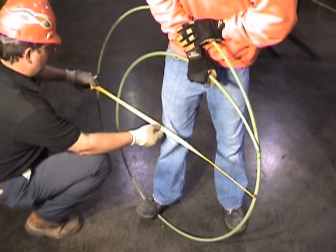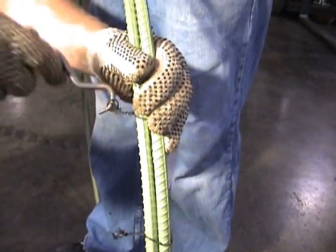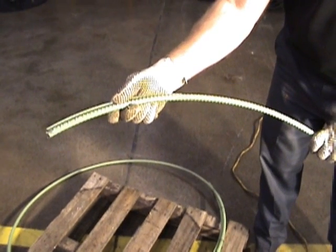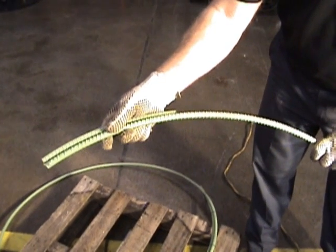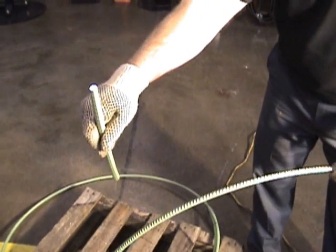The men will be shortening the rebar circles that are provided with the Mr. Manhole tools and using the excess as you'll see demonstrated. Take the excess we cut off — we're going to cut it into four pieces, twelve inches long or so. It could be a little bit less so we stay under the pipe to get a twelve inch fixture. We're going to stick them in the four holes in the flange.